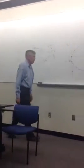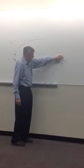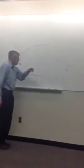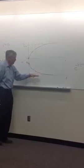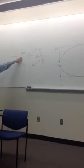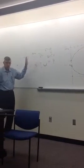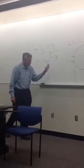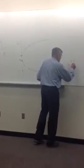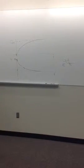Well, if we have a large number here, that's going to have it go down quickly. Now our resistors, if our resistor is large, that's going to slow this whole operation down because we don't get charge going as fast. So it makes sense that R on the bottom would give us sort of what we want.